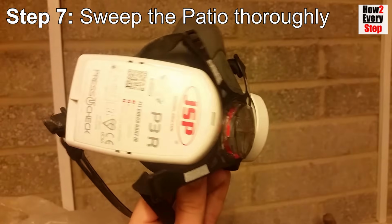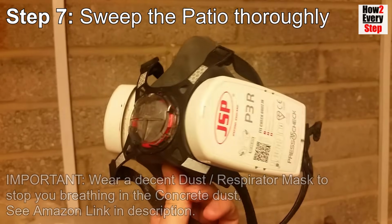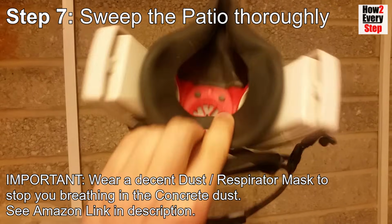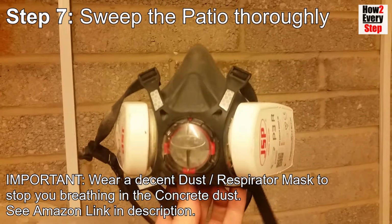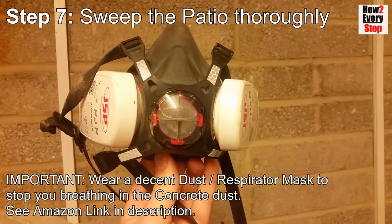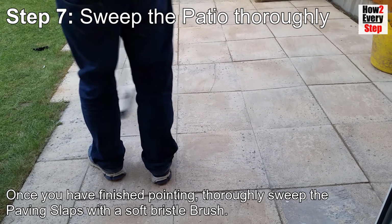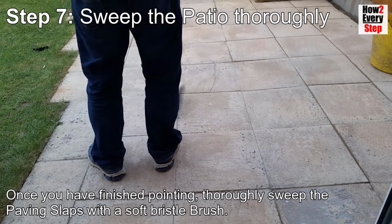Step 7. Sweep the entire patio thoroughly. Important note, wear a decent dust respirator mask to stop you breathing in the concrete dust. See Amazon link in the description below. Once you have finished pointing, thoroughly sweep the paving slabs with a soft bristle brush.